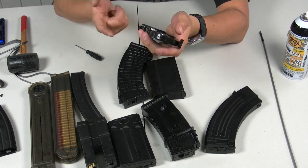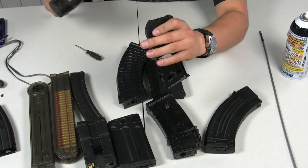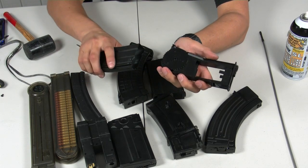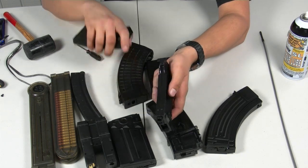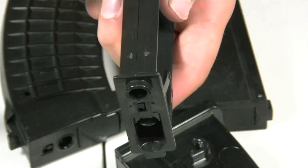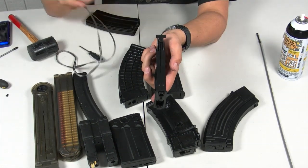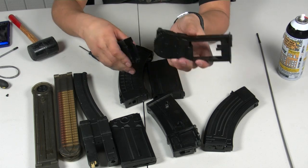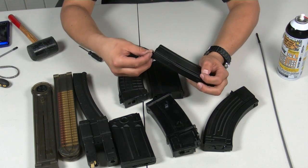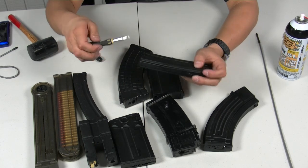You can try tapping it while it's assembled too — just make sure everything is clear from the reservoir. Or you can take the rubber mallet to it — that's what it's for. Once the obstruction is cleared, check for casting errors inside the seam — those can cause issues. The unjamming rod trick addresses those. Once it's all fixed, put the guts back together, push them back in, put the Torx screw back in the bottom, and your magazine should work properly.